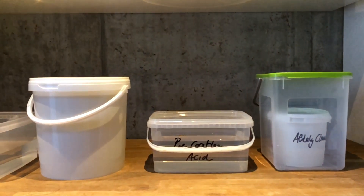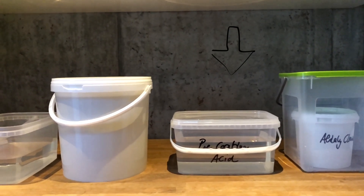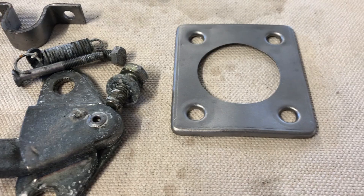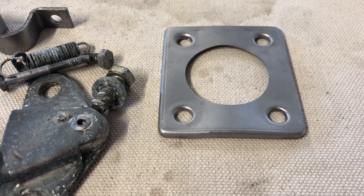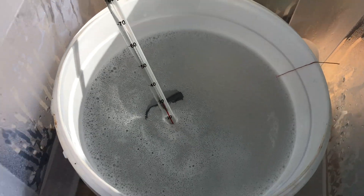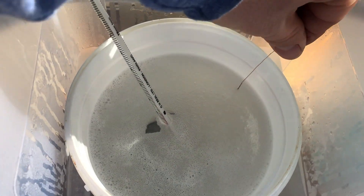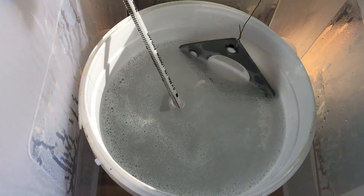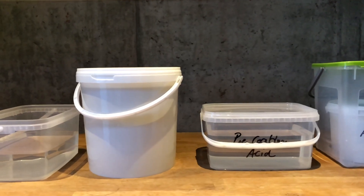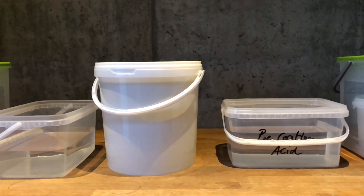Let's go through the process. The kit comes with an alkaline cleaner and some dry acid that etches the surface of the part in preparation for the galvanic coating. The cleaner works very well, especially if you heat it in an additional water bath. When I use HCL to prepare the parts, I simply leave out both the alkaline cleaning and the etching and move on to galvanic plating right away.